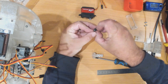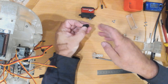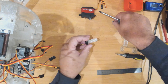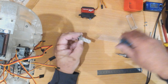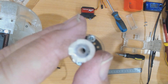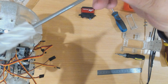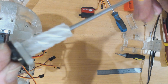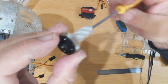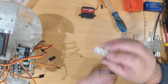We need to screw this component in before we install the servo, so it just pushes in. You will note that there is a small hole up through the middle of this screw part, and that allows a very thin screwdriver — Phillips number zero — to go down and engage into that screw so that we can rotate it. We can now install that into our bar.